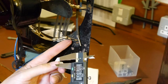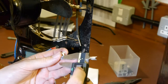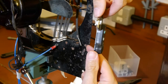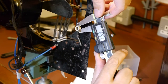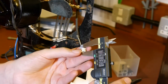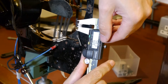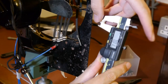It looks like the slot that this thing has to be trapped in - measuring now the narrowest part of the waist of the little ceramic bobbin - that's giving us a reading of 6.87 millimeters, or 275 thou. Let's just measure the thickness: the thickness is 7 millimeters. That's not really critical at all.